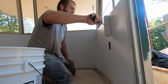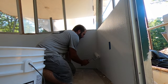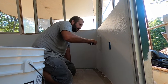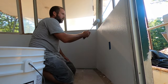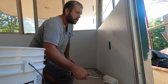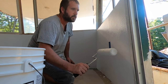I mean, if you don't really care about how it looks, then go ahead, do it. You do you. I'm gonna do me. But having done it for customers asking to get paid for the job, I can tell you, paint and primer in one sucks. In order to get it looking really good, you're gonna end up doing three coats. You might as well just do one coat of primer the right way the first time.